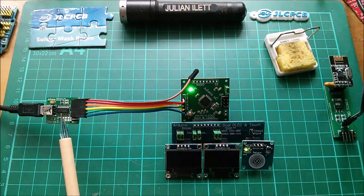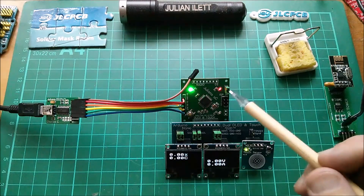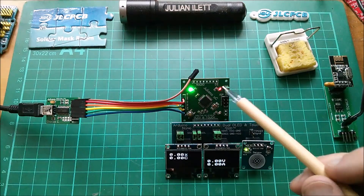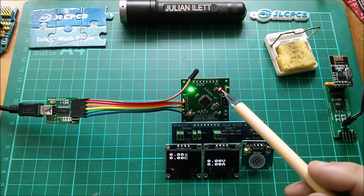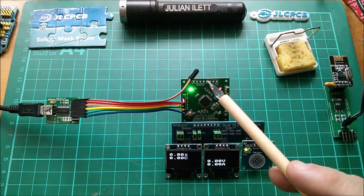It's uploading now — lots of red, lots of green — and it's running. We've got null data there, that's interesting. The D13 light is on a lot, but that's probably because it's trying to talk to the radio tower, which would be the SCK on SPI, and there's nothing there.